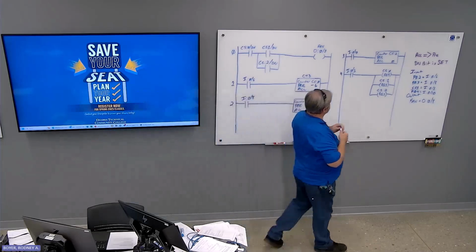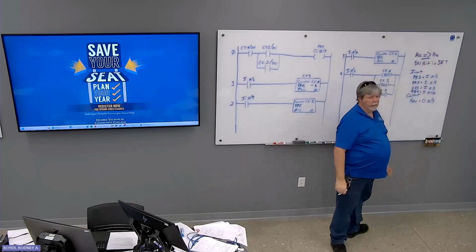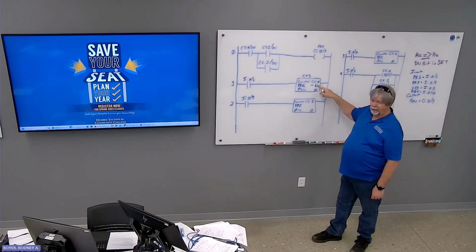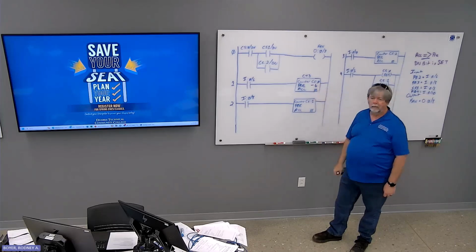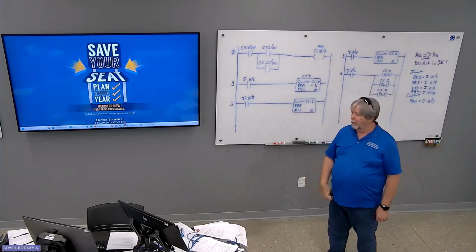So by our definition, the accumulated value is equal to or greater than the preset. 0 is greater than -6, -1 is greater than -6, and so on. -6 is equal to -6, -7 is less than -6. So if you want to push the button 7 times, counting down, you have to set your preset at -6. Okay?